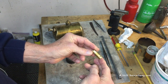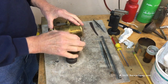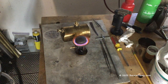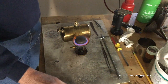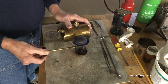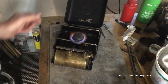At one end there are three holes that are 3.2 millimeters in diameter; at the other end there are four holes—two at 3.2mm and two at 3.6mm. With this setup I'm able to get a reasonable burn at all flame levels. The surging is caused by the explosive vaporization of the volatile alcohol in the burner head—you just have to live with a little surging when using alcohol. This flame is still slightly rich and probably has some water in it, causing a little yellow, but it works better to leave it a little rich than get too lean, which can cause overheating of the outer cap metal. I don't worry about a dedicated alcohol cleaning needle—a regular cleaning needle works fine.